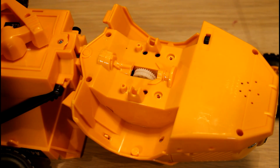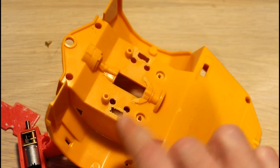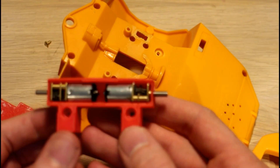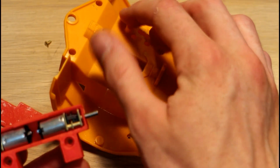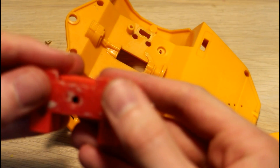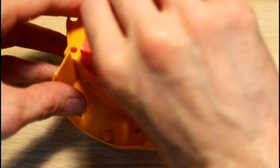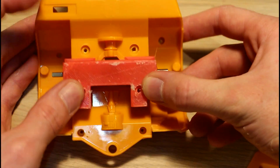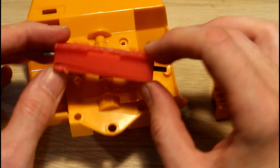Here's my solution. This was the piece we originally had - there used to be two pieces for holding the axle. I got rid of those and 3D printed this little piece to hold two N20 motors. It has holes to line up with the two posts for the bolts. There's another little piece that goes on the bottom to close it up, and that just sits in place. Now I can screw it in using the original bolt holes.